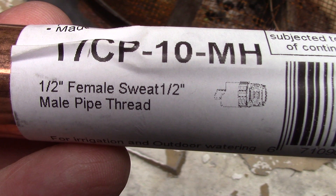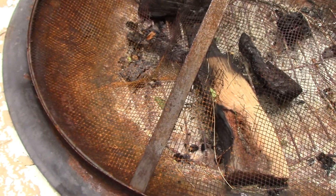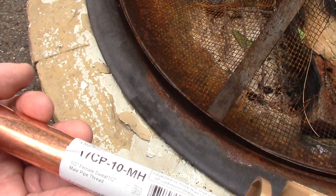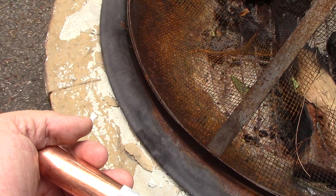It's half-inch male pipe thread, and that is brass. I'm connecting it to copper — when you go brass to copper you have to braze. I haven't had a whole lot of luck with brazing, and what I realized recently is I actually need to contact a company that specializes in brazing brass to copper.